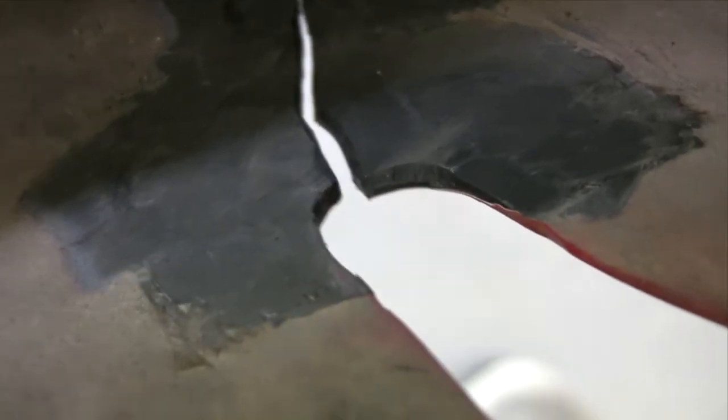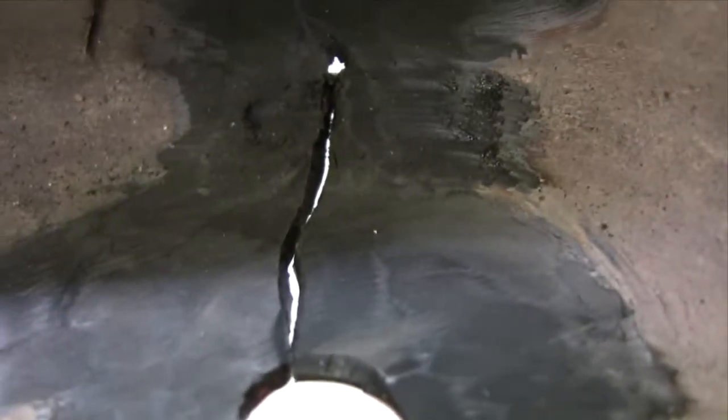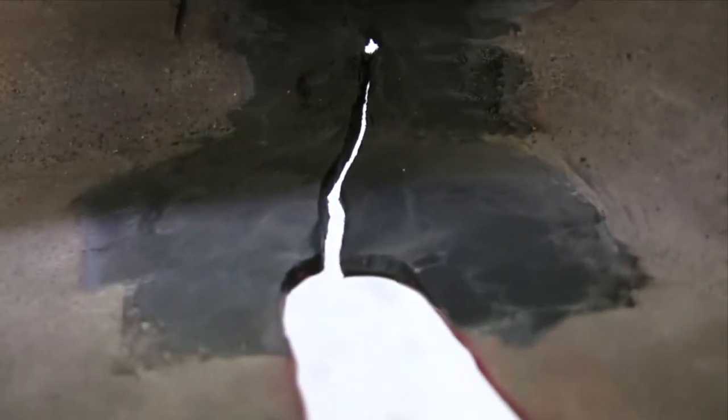Well, that's the inside of that crack there, cleaned up. Someone had glued a patch over the top of it before, so I made sure all the glue was scraped off, and we're just back to the original plastic, because the welding technique actually melts that original plastic as well as putting a filler rod into it. So when it's closed up like that, the filler rod will take care of all the gaps. I'll flip it over and clean up the outside. Probably actually start on the outside and then come back and finish it on the inside.